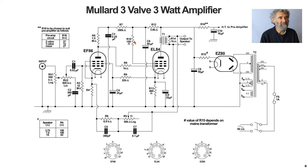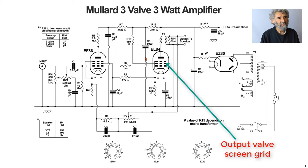There is a small screen resistor with a decoupling capacitor — a more typical value of 3.9k. There is a large 50 microfarad capacitor because the power supply does not have good smoothing and there is no smoothing resistor before the anode. The smoothing must therefore be done here so that ripple does not reach the output valve's screen grid and feed back into the input stage.